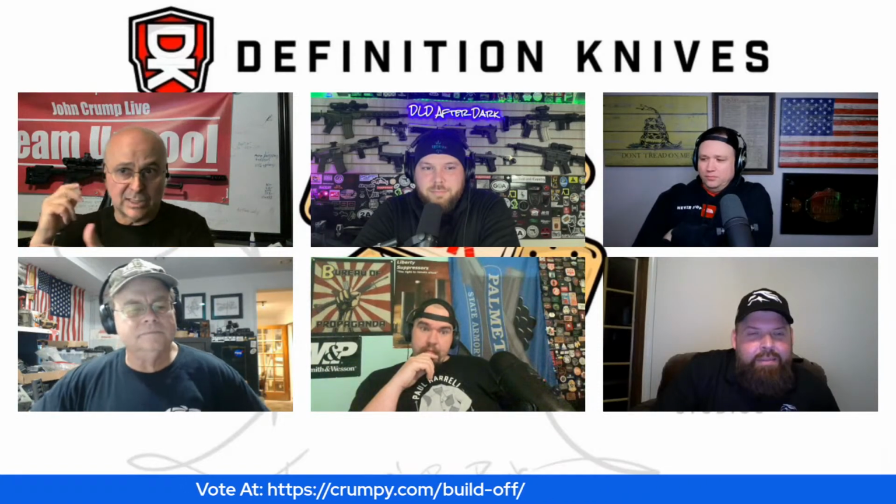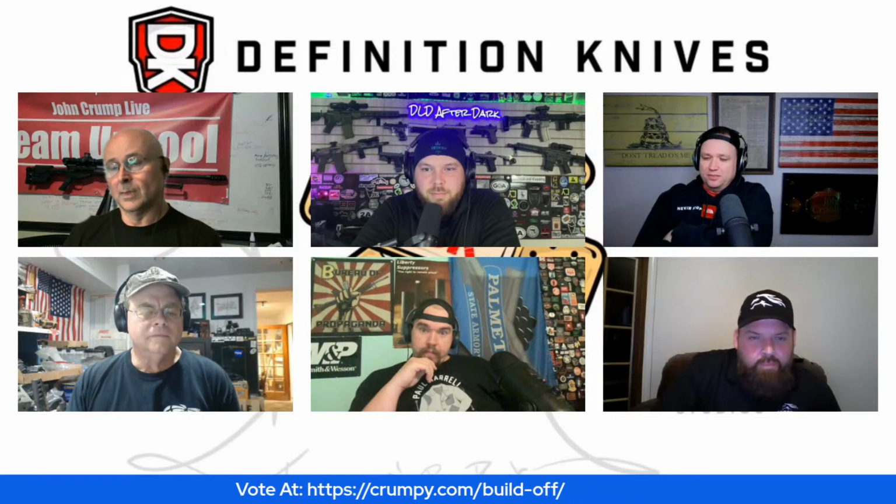So the conflict was between the Bear Creek Arsenal upper and the Anderson lower. It just wasn't gonna work. So I had to harvest the barrel, gas block, and gas tube and swap that onto the Anderson upper, and then that all worked. Did you buy a complete upper? Bear Creek was very kind, and they sent me a complete upper.